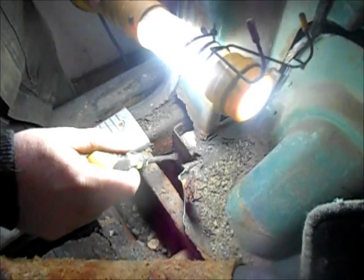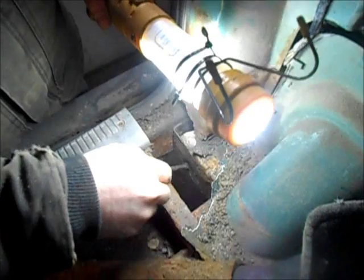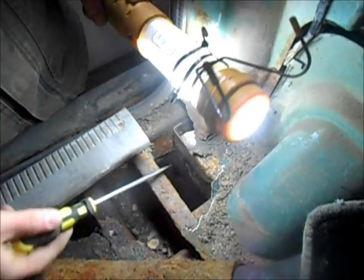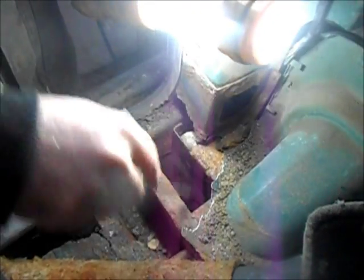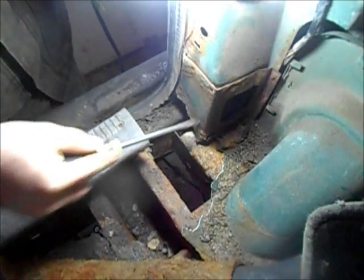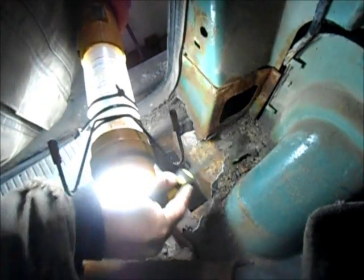Okay, so here's where we are. The spring mount is right here — it's this little L-shape thing. The bolt for the spring comes through this little hole down here and goes through another little hole over here where there's a welded nut. Without any solid metal tying this mount — the frame's still solid, the mount's still solid — a lot of this metal is still solid, but a lot of it isn't. So I'm going to put a patch.